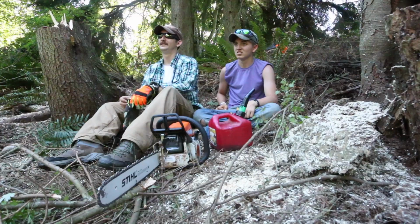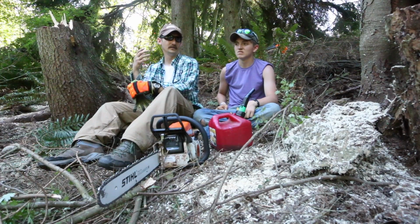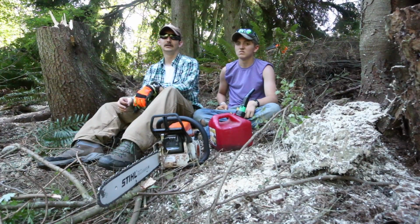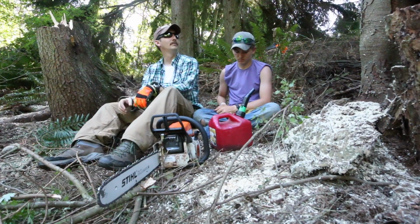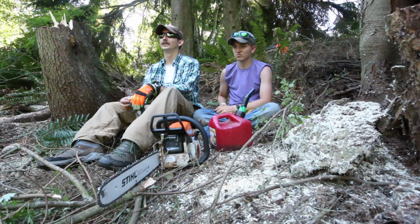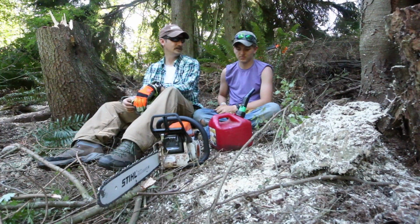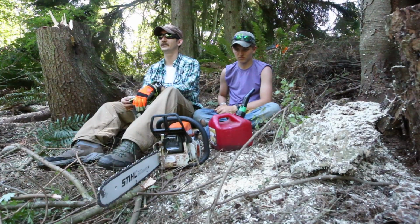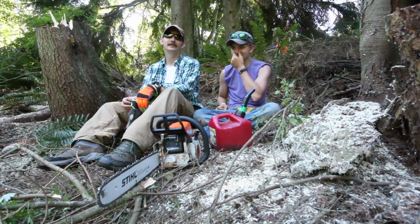Alders are super dangerous trees because they're soft wood, so they don't stand up under compression very well, so they'll start giving very quickly, which makes for a very sporty tree cut. The hemlocks are real strong, so even if they get cut, they'll still stay firm and hard. But the alders are soft, so they'll start to give, which means they'll start to rest on top of your chainsaw. We had to cut the chainsaw out a couple times with the axe.